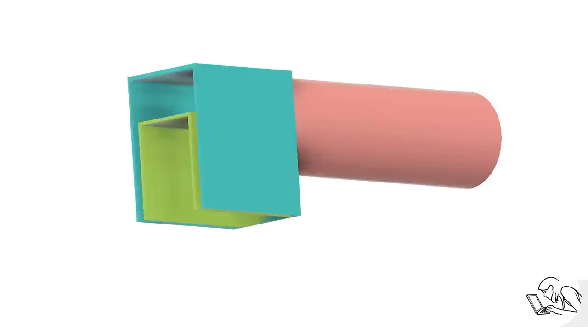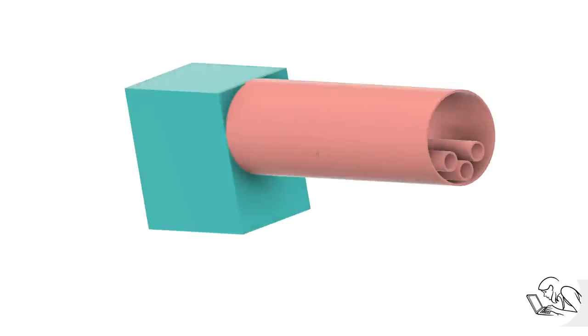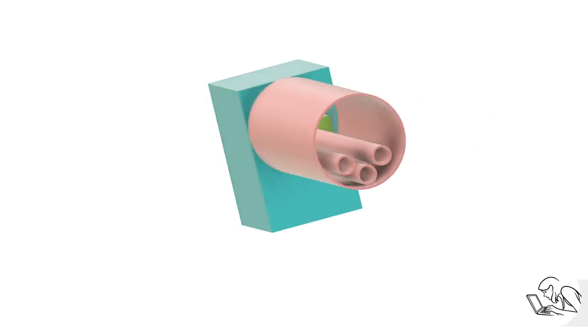90% of the steam is actually created here on what's called the crown sheet. That's the area right above the coal fire. But the smoke tubes do create some steam as well. This is obviously a very complex structure, and the way that you build them is by creating a series of sheet metal parts that are rolled into various forms and then silver soldered together in a giant jigsaw puzzle. So that's the road that we're starting on today.